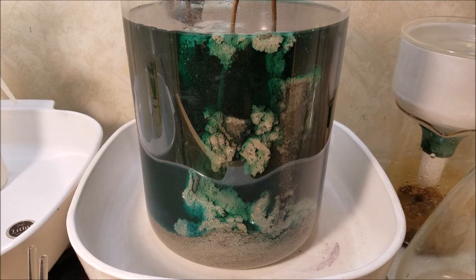Then after that, it starts to get dirty. More copper drops with the silver. Other impurities might pop out as well. You can see it in the color of the silver itself. The initial stuff that flares up and drops is real light and fluffy and white. And then later on, if I would let this sit overnight, you'd see a dark layer of a flatter, powdery type of precipitant that comes out.